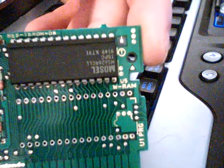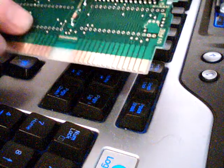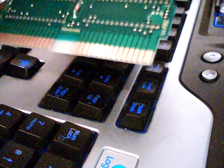You'll end up with, again, this is a different type of board. This is a TS ROM. See right up there at the top, TS ROM. You can see it comes out pretty clean, just using the solder puller. Once that is done, you'll be able to program your EEPROMs.